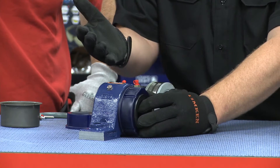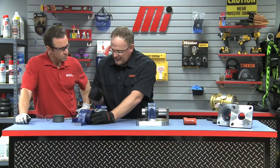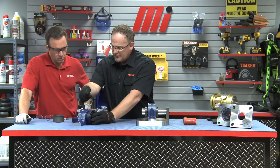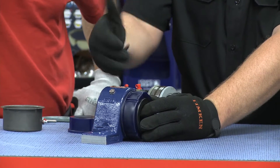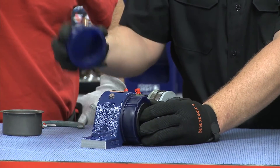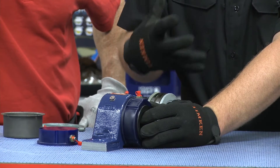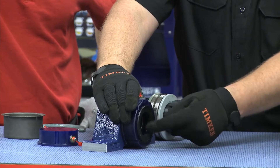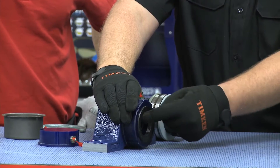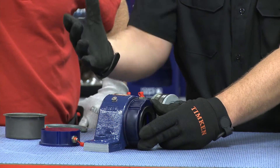The entire seal solution internally starts with a triple lip seal, which gives you three seals. The cap itself gives you your fourth seal. Filling the cavity of that cap with grease — as you can see, all of our caps have grease zerks — gives you your fifth seal. And in the case of our urethane cap, we have a triple lip seal on the ID, which gives you effectively eight seals.